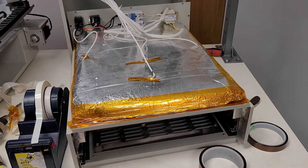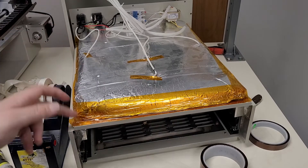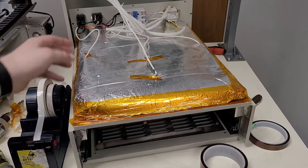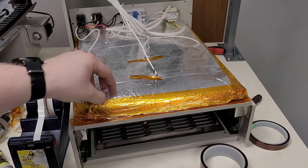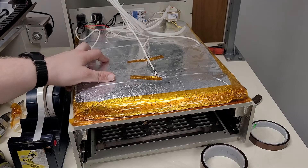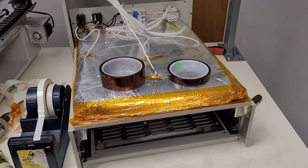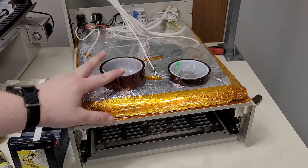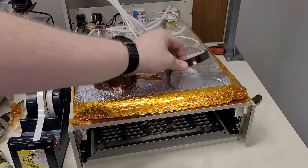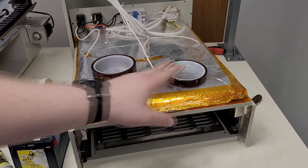The Kapton has been installed. My taping is not the greatest in the world, but it's okay. The tape here is just meant to hold down the glass wool and to insulate around the gaps. I would recommend taping the reflector that goes down in here, but for all the rest of this, just taping around the edges will be fine. I did tape some around the thermocouple inserts because of the aluminum tape coming up. Now, I would suggest you get two different rolls of Kapton — it's expensive, but Kapton tape has great insulating properties, great for this kind of stuff. I would get at least a larger and a smaller roll — this is a one-inch roll and this is a half-inch roll.